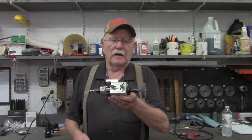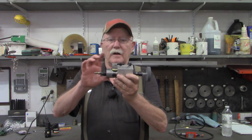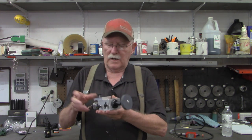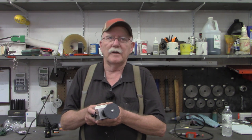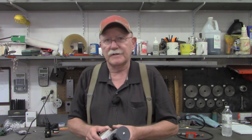Well folks, it was an absolute failure. This thing ain't worth the value of one of those thumb screws. I'll salvage the thumb screws off of this, maybe this stone and that air inlet, but this die grinder is junk. I've had it several years but I've never used it very much at all. It doesn't have any power whatsoever — it would just stall. I put up to about 60 pounds of pressure on it, had this wheel turning about 4,000 RPMs. It's only rated at 3,500 to maybe even 5,000 RPMs. And just as soon as it came in contact with the piece of material — not even hard steel — it would stall out. It would barely produce a spark. So I said all that to say this: this was a failure.